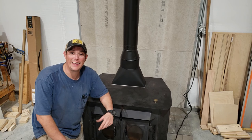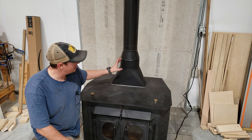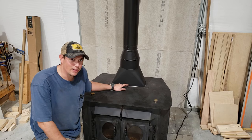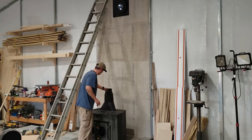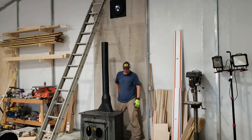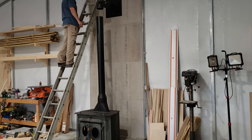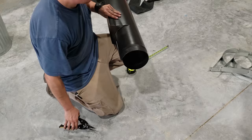Because my wood stove has a rectangular opening on top, I had a really hard time finding the adapter that goes from the rectangle to the eight-inch round. I'll put a link to that in the description below. A lot of these old cast iron stoves, especially ones that were used as fireplace inserts, may have that rectangular opening on top — hopefully I can help you guys find the right adapter. Now we can start installing our interior pipe; this is just black single-wall stove pipe and we're going to keep everything nice and level and measure and cut everything to the size we need.